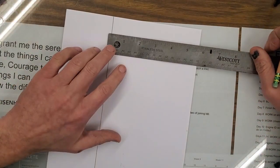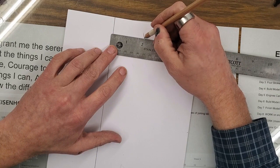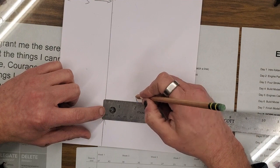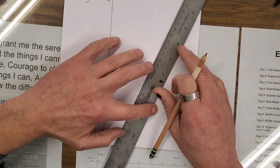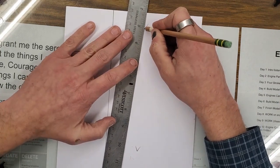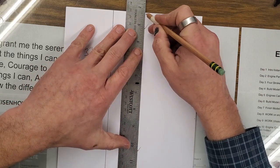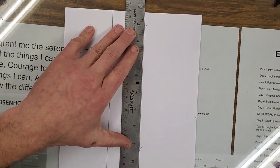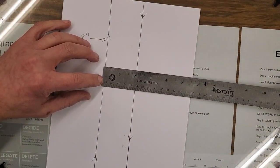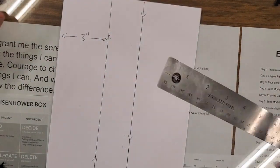This time I'm going to start at zero and go up to two inches, mark my arrow, come down here two inches, mark my arrow, line everything up, pencil on the point. That helps a lot and makes it easier because then all you have to do is line up that other arrow. Measure twice so we only have to cut once — looks good. These two lines are parallel.